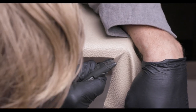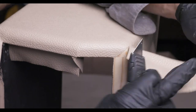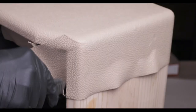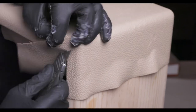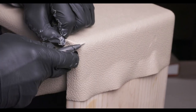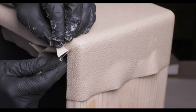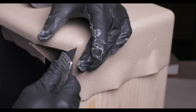Important part of contact cement is you want to apply pressure on the pieces. You can't just stick them together and think that they're glued. You actually have to press them into each other. The heat gun is nice to have on hand because you can use the heat gun to heat something back up and pull it back apart and maybe give it another try if you need to. The Tolex glue can be reactivated with the heat gun, so you're not in a hurry, but you also need to make sure that you don't try and glue pieces that aren't fully dry yet, because they won't stick.